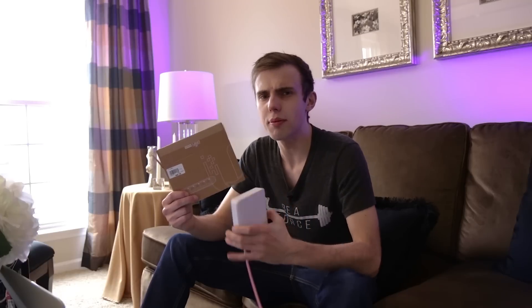This switch is still a five-port gigabit managed switch that gets its power from PoE. The only difference is it does not redistribute that PoE. There are a couple of other differences: the regular USW Flex can only be powered via 802.3af, at, or BT PoE. The USW Flex Mini can be powered the same way as the USW Flex, as well as with an included USB-C adapter — though I say included because the USB-C adapter is only included on the single pack.